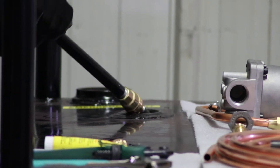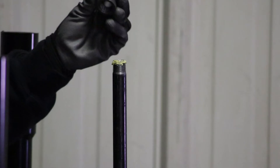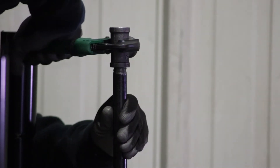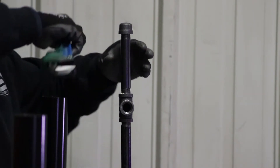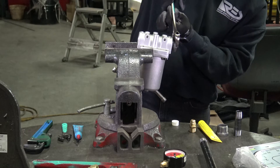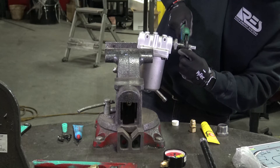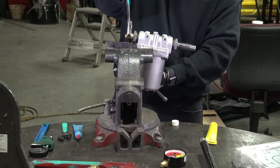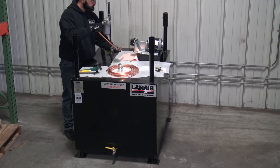Install the lower fuel pickup assembly on the tank using the bung opposite the pump bracket. Begin building the upper fuel pickup by attaching a T fitting to the top of the pickup tube. Next, attach the longer vertical nipple and cap it off. Using a vise, preassemble the primary strainer assembly, which is comprised of the primary strainer, an intake adapter bushing, the shorter horizontal nipple, an output adapter bushing, a brass flare fitting adapter, and a vacuum gauge. Affix the primary strainer assembly to the pickup T.